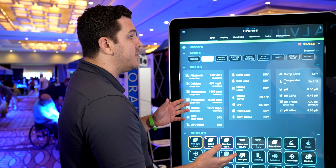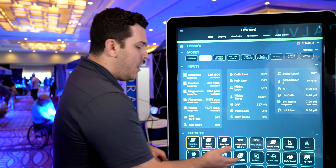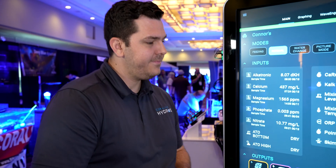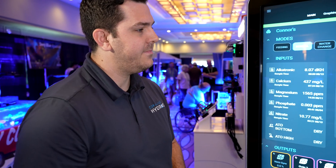One of the big things that's changed is temperature. Obviously you can always have multi-level temperature inputs, but if you have two temperature sensors and you want to trust both of them, your heater output can be based on two temperature sensors. Small things like that — looking at the big picture. So if I'm trusting two sensors and one fails, then what happens? The highest one flags red. We've got all these new capabilities, not only with sharing but some tweaks in the UI as well.